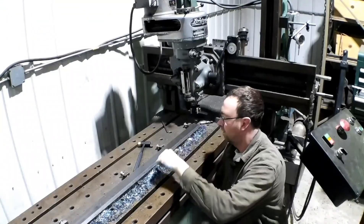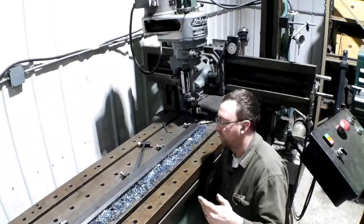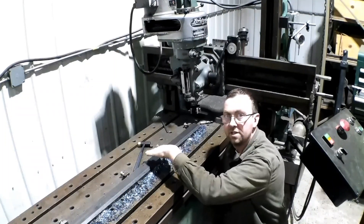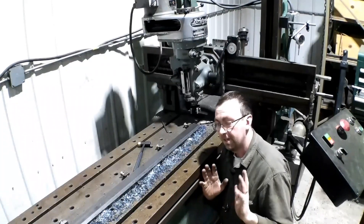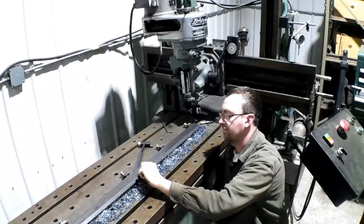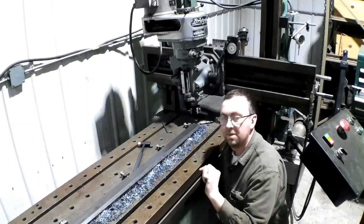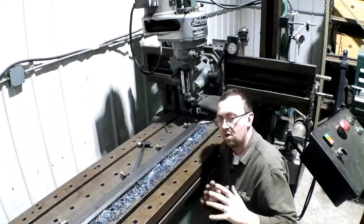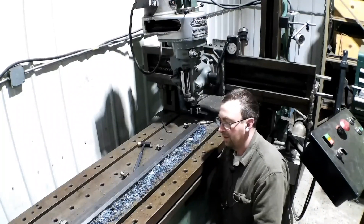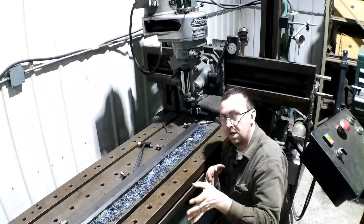We have the first one milled out. There are four pieces total — two long ones and two short ones. We're on the last one; I got that edge milled out, and now I'm set up to mill this surface. Before you guys beat me up, let me explain why I did it this way. Generally you would want to do your big surface first, but because you're taking this surface down with a regular end mill, the problem is that when you get into longer pieces, the stuff starts to warp, which makes it difficult to get it clamped down.